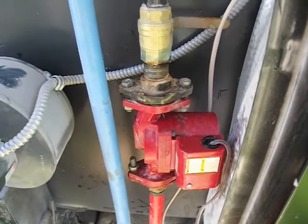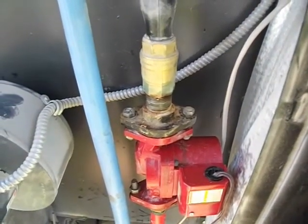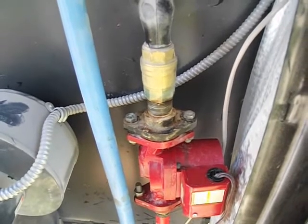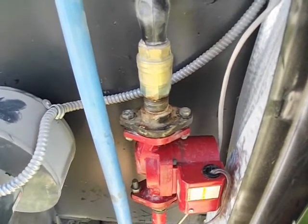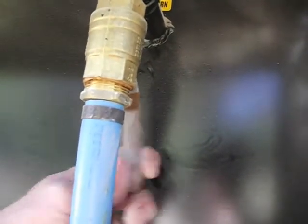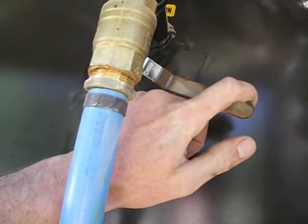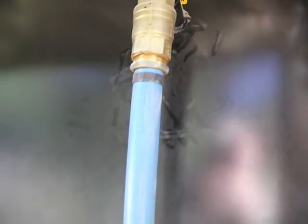So we're bolted back up. I'll open the supply valve — you can hear the air bubbles go back up into the tank. It's important you let that air out of there before you start the pump running. Now open the return valve, and you're ready to plug it in. You may hear an air bubble or two come through. After it's running for a few seconds you can check — I can feel on the return valve the water flowing through when I squeeze it. It's up and running and you're back ready to go. Thanks for watching.